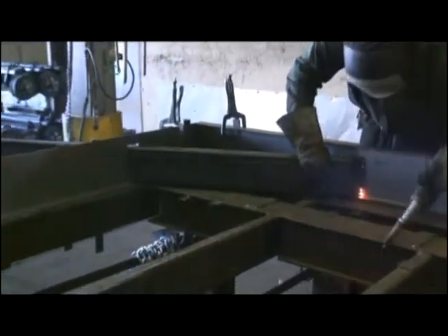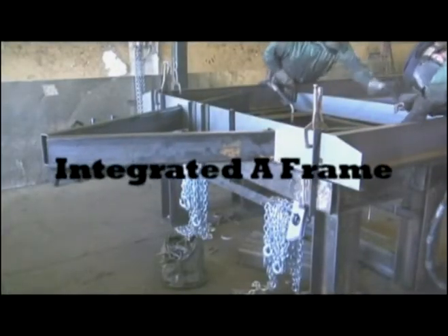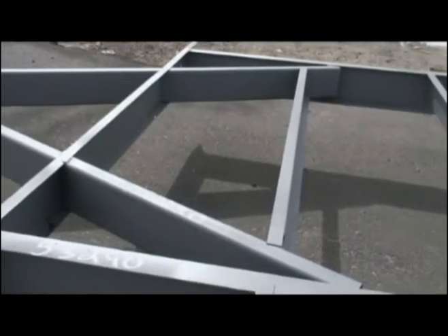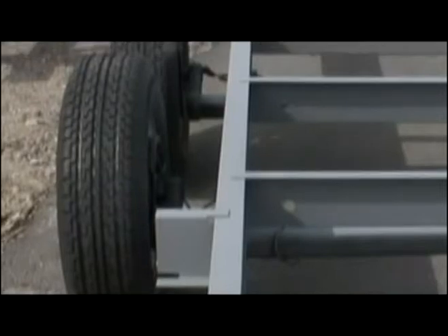Opposed to an A-frame that is welded to the underside, all of our frames incorporate an integrated A-frame tongue design that ties directly into the main rails on the chassis, providing extra strength and better towing handling. Larger tandem axle trailers are built on 8-inch steel I-beams, independently tested and confirmed as superior to the 6-inch tube most often found on these trailers.